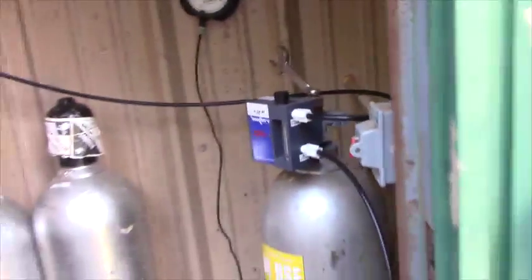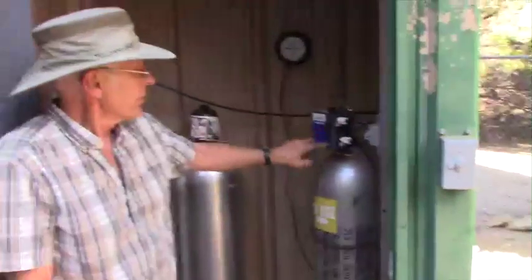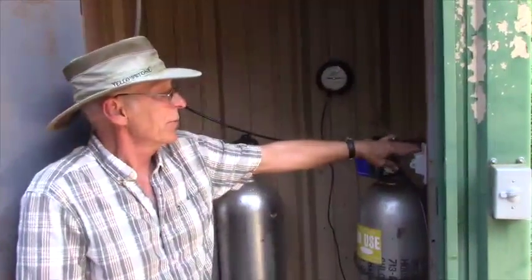They take a daily reading except on weekends. This is the pressure regulator out of the chlorine gas — it runs gas through and measures how much you use in the rotometer here. This chlorine gas tubing is what you see coming in the other side to the venturi.